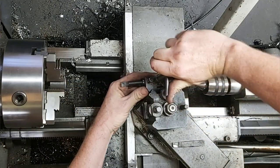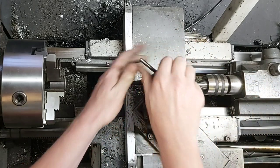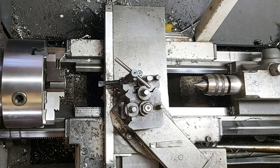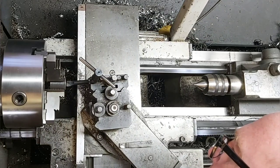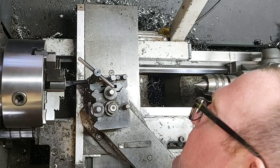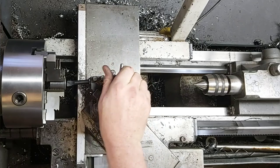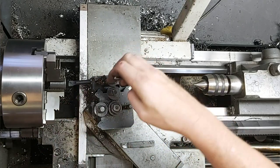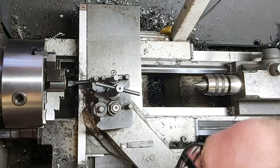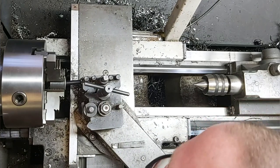One of the other challenges is that this has a round shank on it, so I have to be very careful I get the tool bit on the correct horizon with where I want to cut. Before I start cutting, I want to get my head in there and just make sure that it's not rubbing on the backside or anything. Although I do have 150 thousandths to take off, it's just good practice to make sure it's not going to rub anywhere. And it's a good thing I did, because I noticed my height could be adjusted just a little bit to improve it.